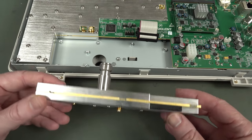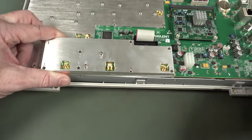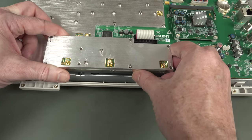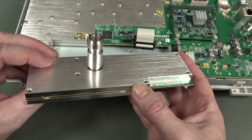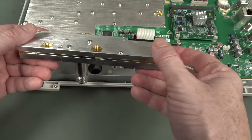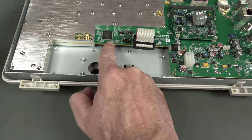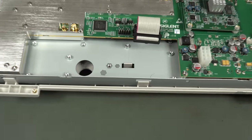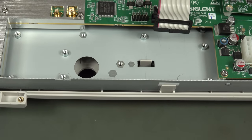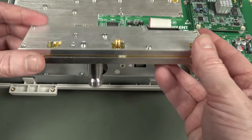Let's have a look at the tracking generator. It's got two connectors, as opposed to the 3000 model which only has the one. One of them is presumably going to be the required VNA measurement aspect. It's interesting that they put it on a separate board - you can tell by the mouse bites that it was actually part of the main PCB panel, assembled at the same time by the same pick-and-place machine, but then snapped off and used as a separate module.